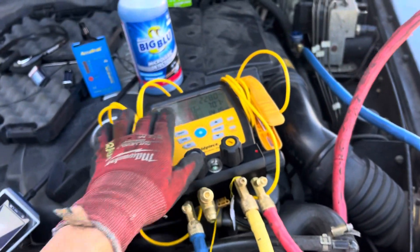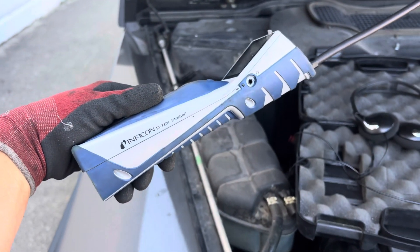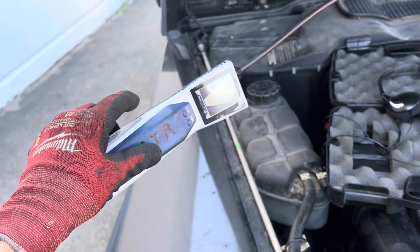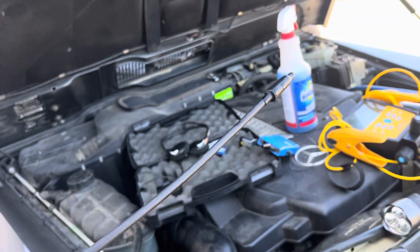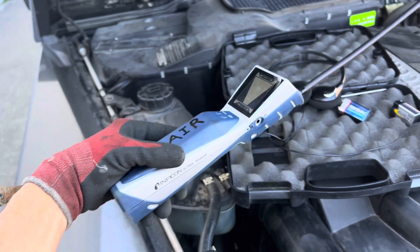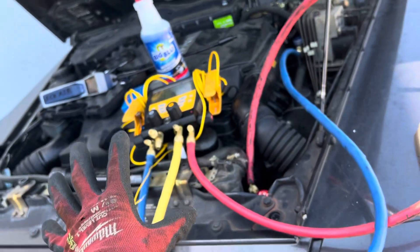Under static test conditions at 228 psi, there is no leak to be found at any of these sources. This is the Inficon Stratus - one of the most absolutely sensitive leak detectors. I have it on super mode, the most sensitive sensor position. I actually own and purchased the lab test reference leak detector bottles that you keep in your refrigerator to calibrate and make sure you're reading the absolute smallest leaks possible. Went around with the ultrasonic - nothing. Went around with the micro leak detector bubble on all these locations - nothing - because this is a static test.